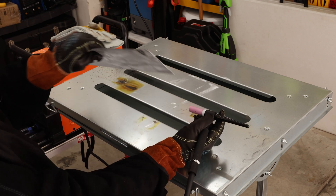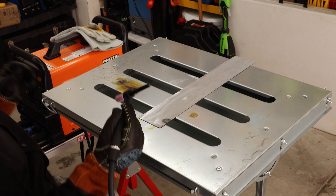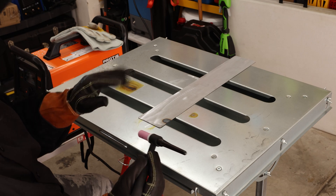That's one of the nice things about a TIG welder — you can weld really thin stuff without burning a hole through it. So I'm going to do a max of 50 amps, which means when I push the pedal all the way to the floor I'm getting 50 amps, but I can still vary that. And with filler rod — that's aluminum, so I'm going with that. That is a cool thing about TIG welding: you don't need to change the gas. You can do everything with one bottle, you just change the filler rod.